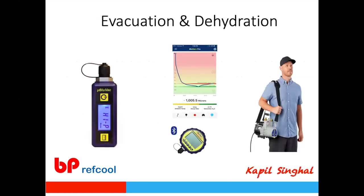Once the pressure test passes, you proceed to vacuuming and dehydration. The key tool required is a vacuum gauge, because measuring the level of vacuum is very important. There must also be a vacuum leak test — you leave the vacuum at the achieved level and ensure it does not rise beyond the minimum acceptable level within 10 minutes, 15 minutes, or one hour, depending on system criticality and OEM recommendations.